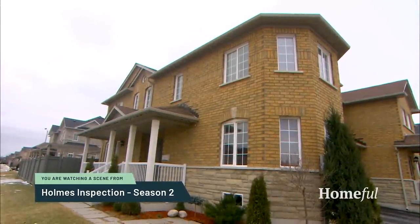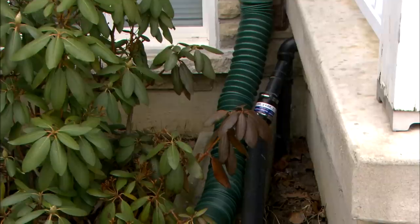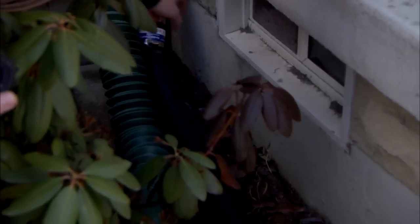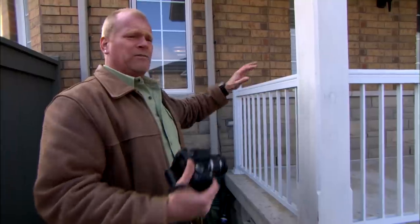The pipe that gets the water out of the sump pump is underground and it's frozen. I had gone downstairs just to grab something and I heard loud crashes of water coming from our cold room. When the sump pump was trying to pump the water out, it blew the joint — it started shooting everywhere. There was water all over the cold room, water pouring into the basement. I'm really disappointed with the exhaust system from the sump pump that's in the cold room. In the freezing winter, it'll freeze that line and it won't come out — it'll break the line downstairs. It'll try to discharge water but it's frozen, so it won't. That's exactly what happened: it snapped right at the junction point and then there was water downstairs.